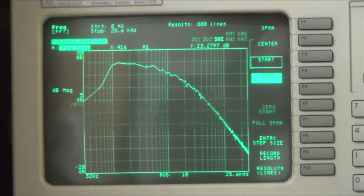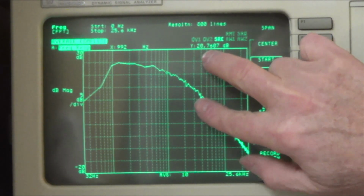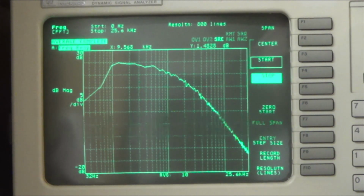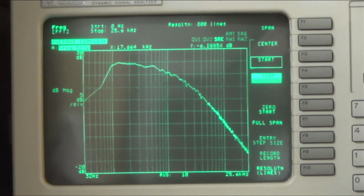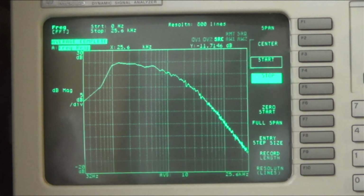and we're flat up until we get to about 1K. And then we're starting to drop off, but really this is not very much. This is decibels, so it's not really very much of a drop off here. But then as we start going up in signal, there's 2K. Now we're starting to have a real difference. 15 dB. We're dropping down 30 dB from here down to here.